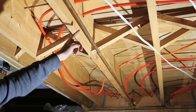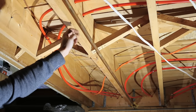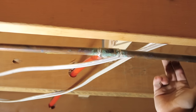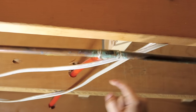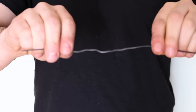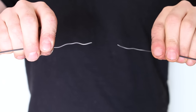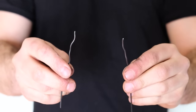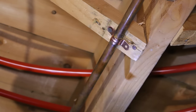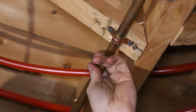Number eighteen, not hanging your pipes correctly. This could sometimes be overlooked but it mustn't be for copper water lines. Not hanging your pipes correctly could eventually weaken them and cause them to fail at a joint, resulting in water damage. Think of it like a metal wire — if bent a couple of times, it'll just break off. To make sure this doesn't happen, always add a hanger at every six feet or so for half-inch and three-quarter-inch copper lines.